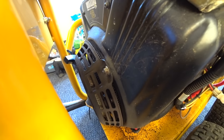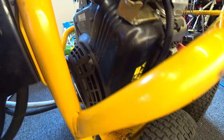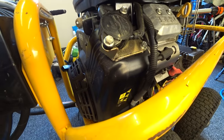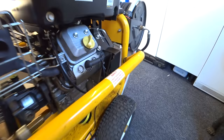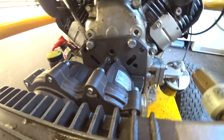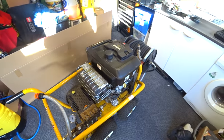You can see around here there is quite a lot of oil spatter and spray. I've got a feeling it is the rear crankshaft seal that is leaking, which is behind this pull-start and fan mechanism. I spoke to the guy who supplied me the engine — very knowledgeable in these — and he said one of the main causes would be a crankshaft seal. He said it drips down there and the cause of the spray is because there's a fan in the back. When it's running on full, the fan trying to cool the engine picks up tiny droplets of oil from the crankshaft seal and blows it through the engine. You can see oil spatter everywhere and oil sitting in a little channel on top of the gearbox.